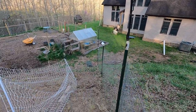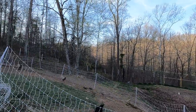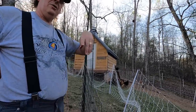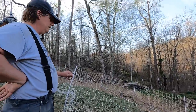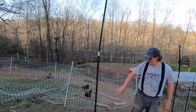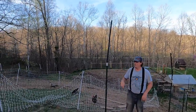But now, as you can see, all the way around our fancy fence to all the white step-in posts, all the way around behind the chicken church, and then here at the front corner of the chicken church, where there will be a gate to here all the way back down to the greenhouse, that this will be our deer barrier. And then we'll of course put electric along the bottom, all the way, two strands of electric at the bottom with insulator sticking out to deter raccoon, possum, those type of things from trying to get in and obviously lay harm to our chickens.